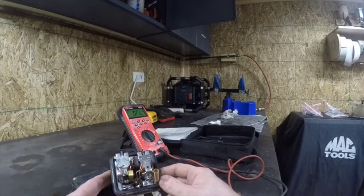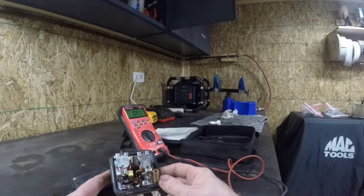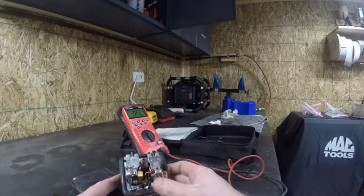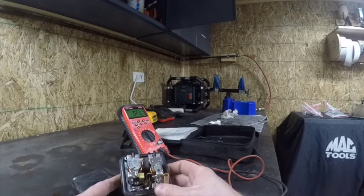This is where you're going to take off and power your ignition switch, your lights, or any kind of other electrical accessory. Usually you go up to your ignition switch and then you go off from there. You go down for your starter and out to your ignition coil and out to your light switch and so forth. Not all voltage regulators have that, and you do not have to use it if you don't want to.